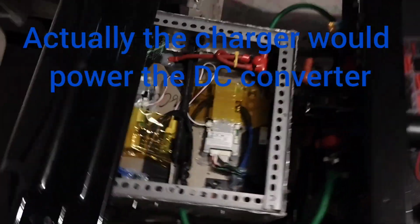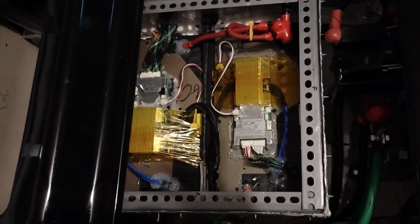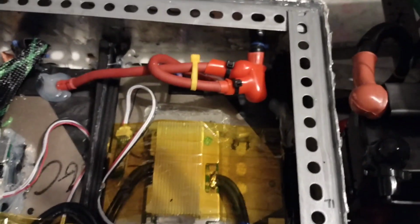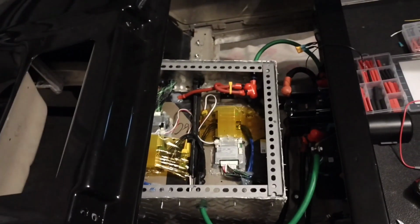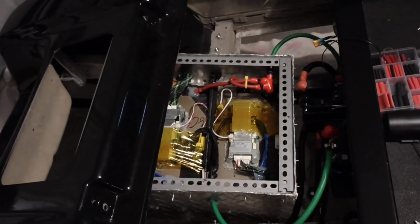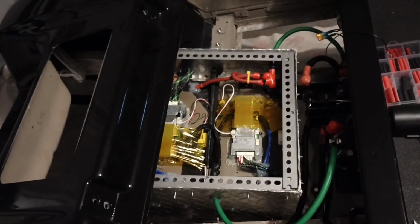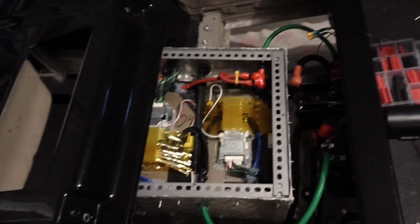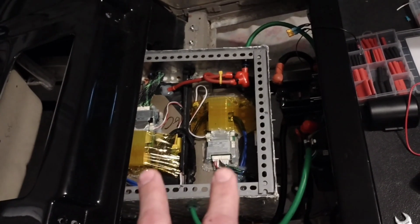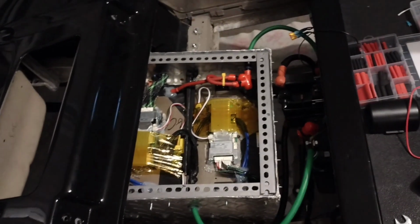And that's where the battery is at. Everything's sealed up and siliconed down, all the connections, like the positive, and everything is nice and tidy. I have to put the top on, but I want to make sure everything is working correctly, as I've already swapped out the BMSs a few times trying to get the other ones to work. These should be fine. They could do 80 amps continuous each, so that should be 160 amps continuous between the two, and they should be able to hit those 400 amp spikes, no problem.